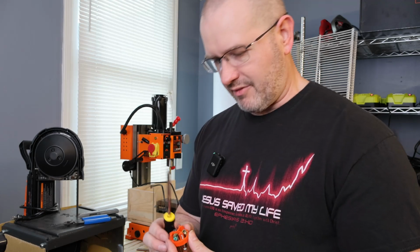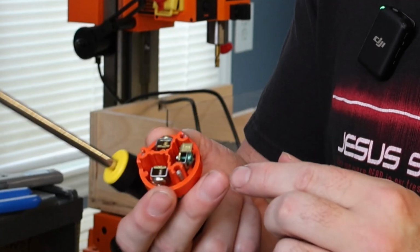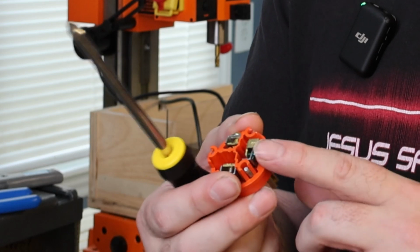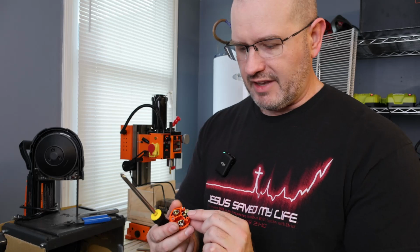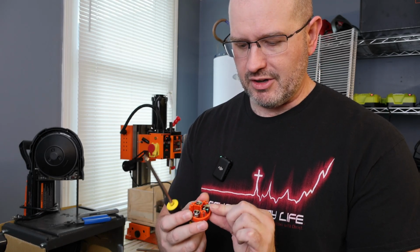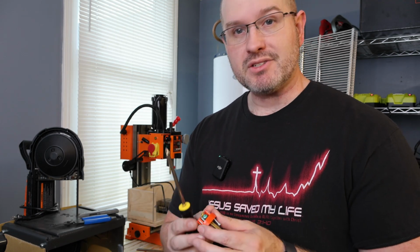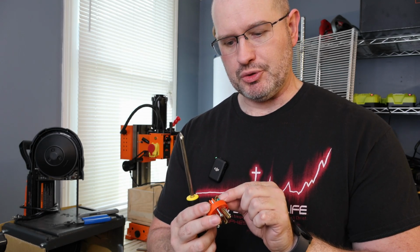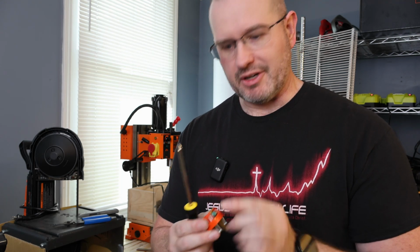Now, what we have is the 3 lugs right here. 1, 2, and 3. Now, as I said, ground is really easy to be able to see which one it is. It looks different from the other 2. Like I say, it's this one that's all curled up. You look on the inside of this particular one. Now, these do tend to look a little bit different, but this one has a little cover over it that says GR, indicating ground. And then the biggest way that you can tell a ground is they usually end up painting the screw green. So that way you know this is the ground. So we can see that this is the ground.